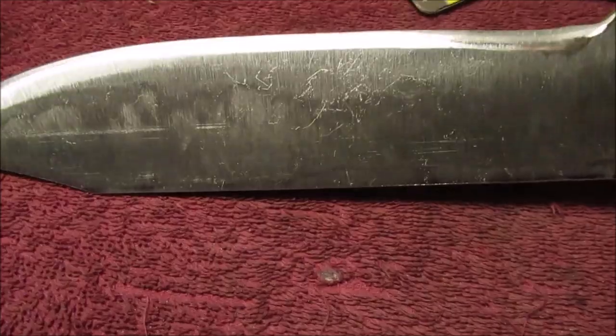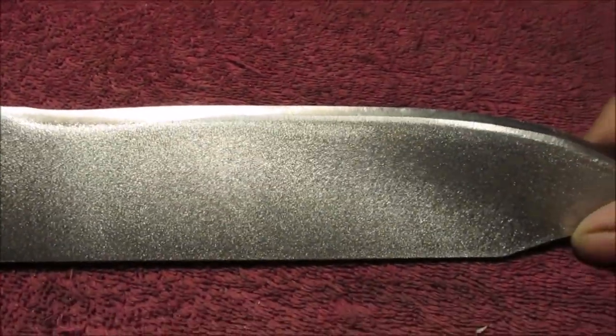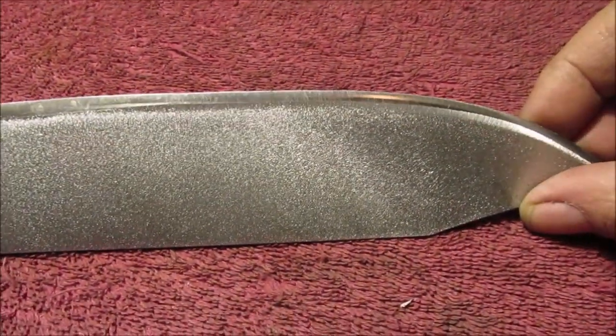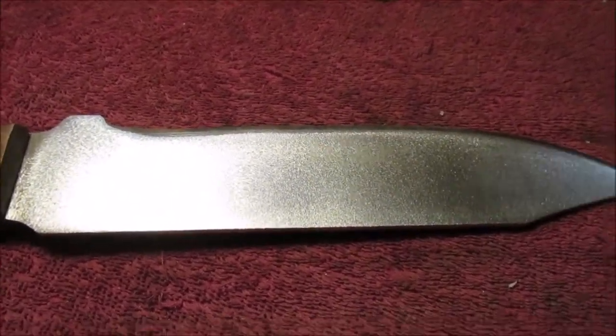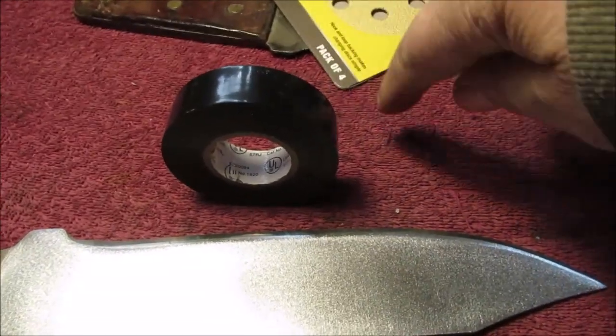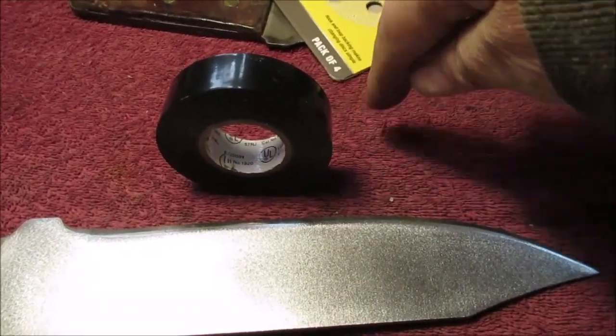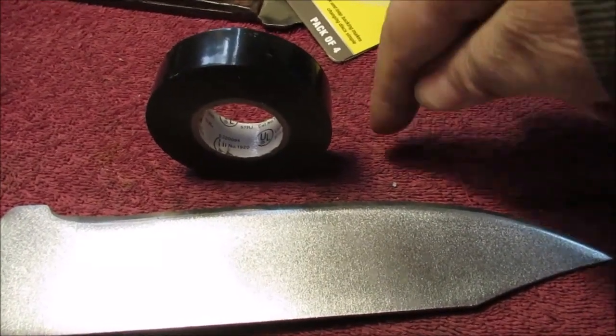If I had a 1-inch belt sander with the right grits, I could probably polish it. We did reprofile the blade just a little bit, but that's almost impossible on a belt sander that wide. And another tip, when you're out there on the end of your roller, don't go in the middle. Those things are beveled, so the belt tracks. Never go in the middle, because that's plastic on the Harbor Freight thing. You'll just wear it off. It's already wearing just by using it.